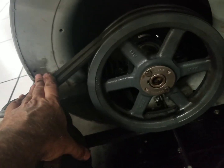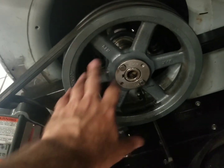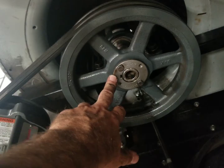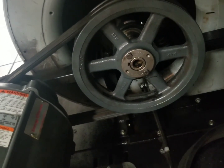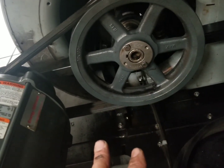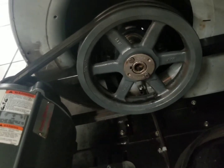The belts are on, adjusted, and aligned. The pulleys are on with the hub, bearings are on nice and tight, set screws are in. So now it's time to test this and clean this area up. That's it, guys — happy HVACing.